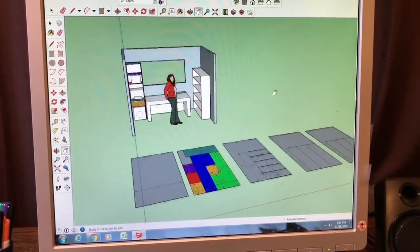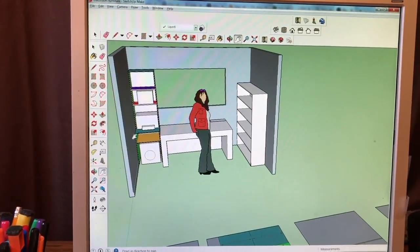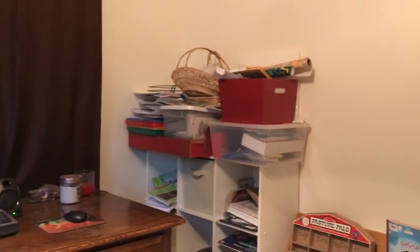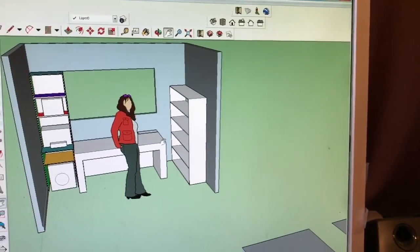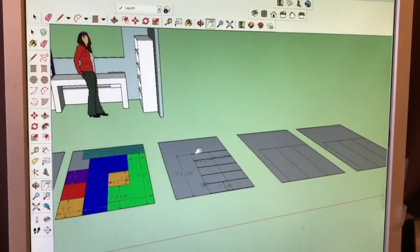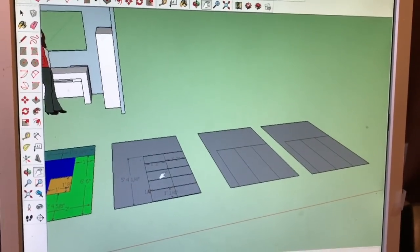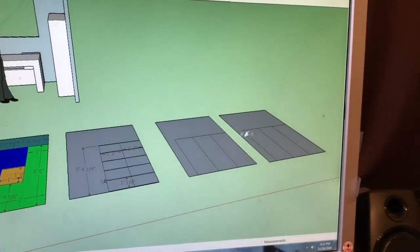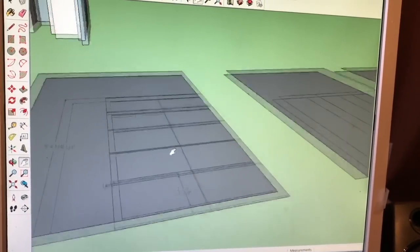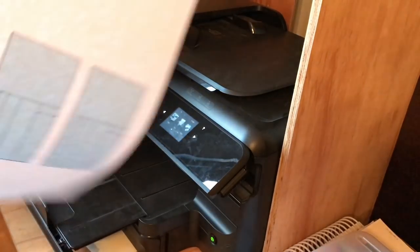The first thing I did was get into Google SketchUp and draw out the room I'm building this furniture for so I have actual correct dimensions. For example, this weird-looking shelf with a cat box underneath it corresponds to what's actually in the room, and over there is where the new shelf is supposed to go. The cool thing about SketchUp is it uses real dimensions, so being very visual, it takes out a lot of the math and the possibility for mixed-up measurements. I took what I needed, measured everything out, and put it on my 4x8 sheets. I've even got the measurements on there, so I can just print this out — these three guys — and now I have a cut sheet.